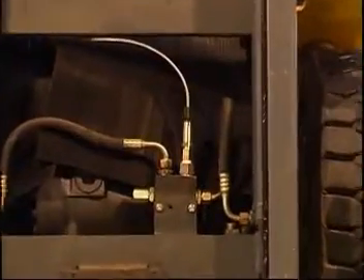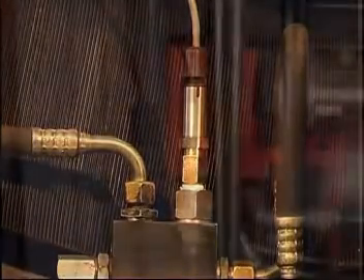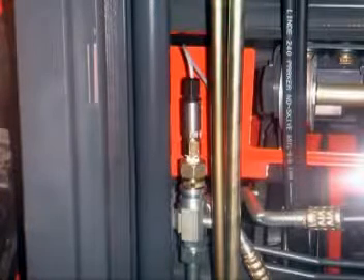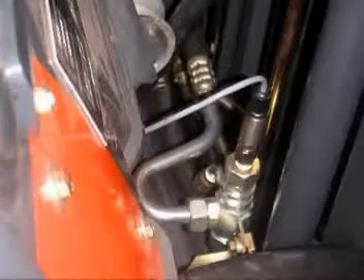The majority of pressure transducer installations in the vehicle lifting hydraulic system require some kind of T-piece. In addition to the T-piece installation method, the pressure transducer can be installed in the flow divider either in the spare plug for connection of the hydraulic hoses or by drilling and tapping for 1/4 inch 18 NPT in the flow divider body or any larger elbow in the lifting hydraulic line.